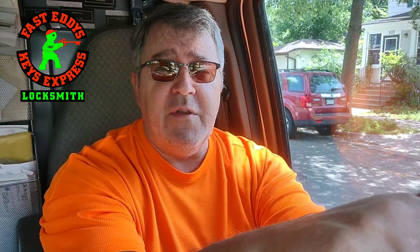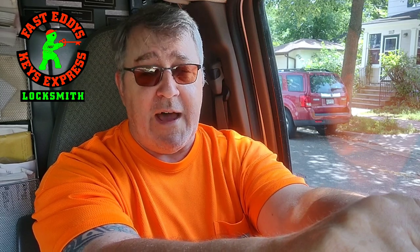It's very simple folks — you need to stop slamming the door. There are no aftermarket products to rectify this situation that I know of, even though a lot of customers believe a locksmith should be able to fix it. The best thing to remember is to put an extreme amount of pressure on the inside of the door and turn the knob at the same time, then pull towards you. If you're on the outside, grab the knob, give it a yank, pull it towards you, turn it, and push the door open. I don't think a locksmith can solve this issue for you.